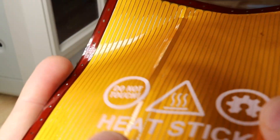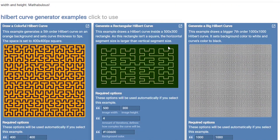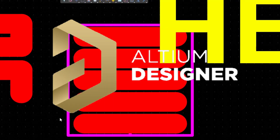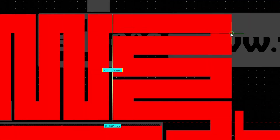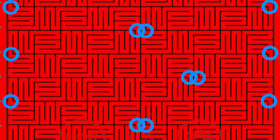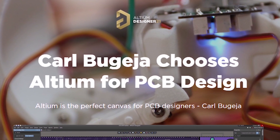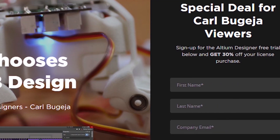I think this had to do with how the track was routed, because the copper was only going in one direction. I researched some different fill patterns and opened Altium Designer to redesign it. With this new method, the track changes direction every one centimeter, so the gaps always have a minimum of two copper tracks passing through. Routing it was very simple — I just created two tracks and then arrayed the rest using Altium's paste array feature, which created an epic PCB maze.